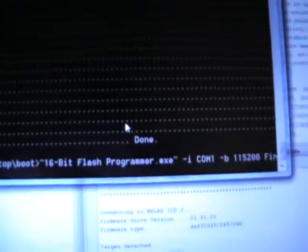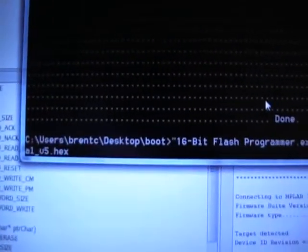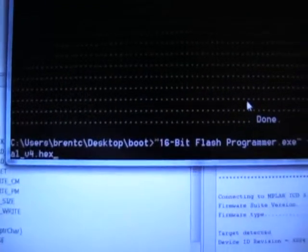As you can see, there are no LEDs lit. It's in boot mode and has no program memory. The way the bootloader works is: when powered up, the microcontroller runs in boot mode. It gives about 14 seconds to load a new program, and then it will jump into the user code. Right now there's no user code. So we'll go to our app, which communicates through the serial port, to program a firmware version. I'm going to program through COM1 at 115.2K, version 4 first.